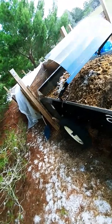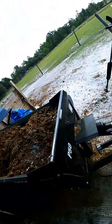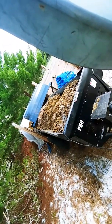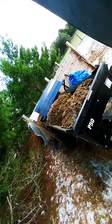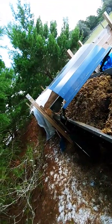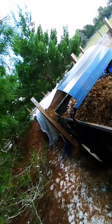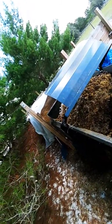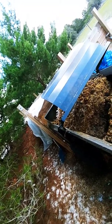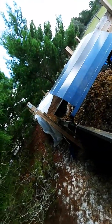The nice thing about this is it's going to shred it as it's putting it out. I'm going to slow it down a little bit. It'll spray it out and kick that manure up pretty high. But you can adjust how far out the material spreads by the speed setting on the PTO.